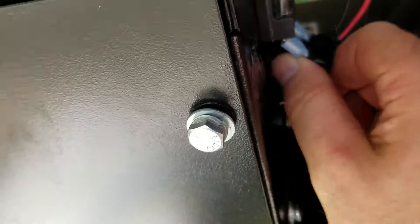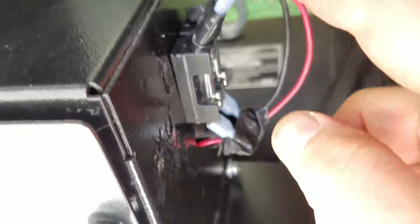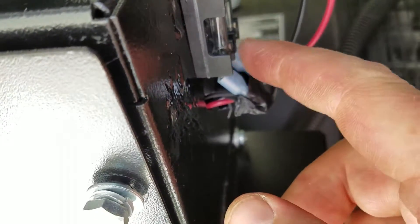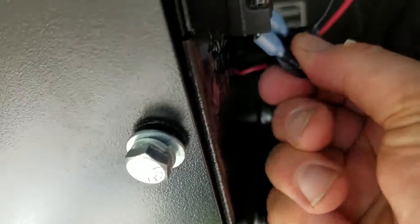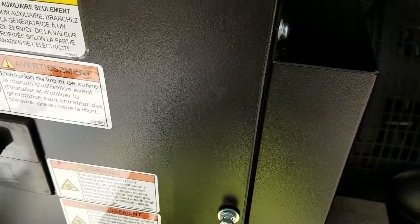Let me just make it look a little nicer. I wrapped it up in electrical tape. The power now comes in at 240 volts — 120 and 120. It goes down here and comes out. This goes to the block heater from the bottom. There are fuses you can easily see — those will burn out if there's a short. I put the cover back on and just have to tighten it up. I got my nice Harbor Freight socket for the power drill and we'll just connect it — easy as one, two, three.